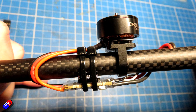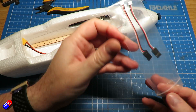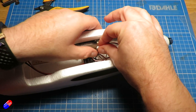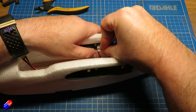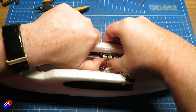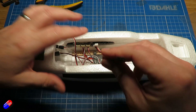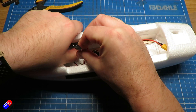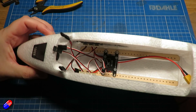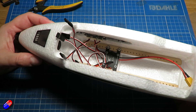There are just a couple of parts left from that big pile. If you've been following along you've probably only got two little bags left — one of them is for the connectors and the other is probably holding the propellers. These connectors go into the empty spots that were designed for the LEDs. We need three connections on each side: one for the aileron, one for controlling the ESC for the motor, and one for controlling the tilt servo. The aileron can be a Y-cable, but we need two individual wires for individual control over both throttles and both tilt positions.